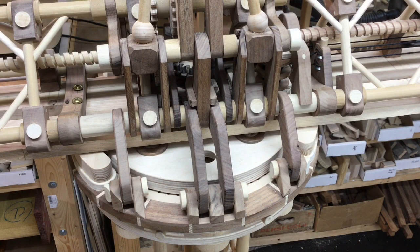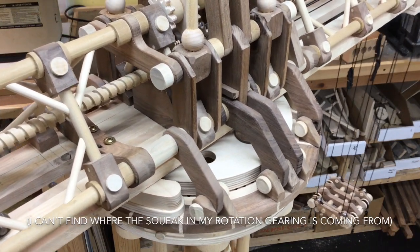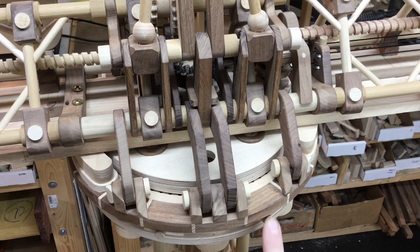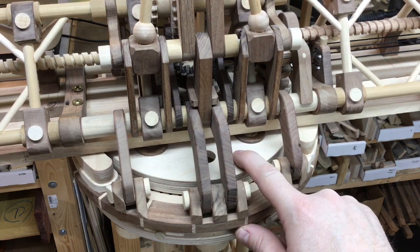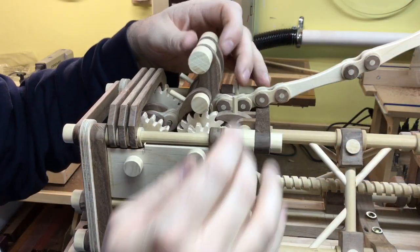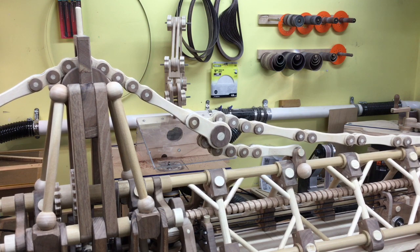Now I'm up at the top of the tower here, right where the boom attaches to the tower. I'm going to rotate the boom and I want you to pay close attention to what moves and what doesn't. This segmented wheel right here is another one of those segmented gears like at the bottom, and the entire boom is mounted onto it. This plate sandwiches this gear in place — it's loose enough to rotate but keeps the whole boom from falling off. The wooden chain running from the very front of the crane over the mast to the back isn't just for show. I built in a little ratchet mechanism so that this chain is actually used to tension the boom and keep any sag from developing.